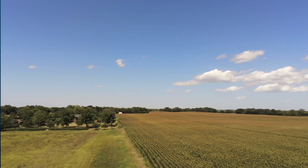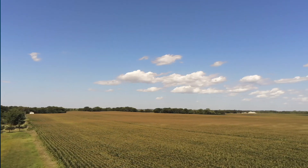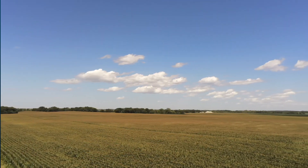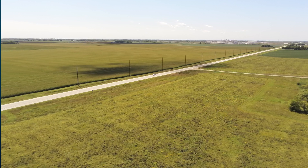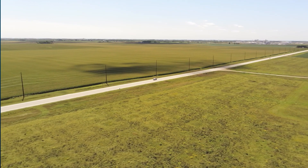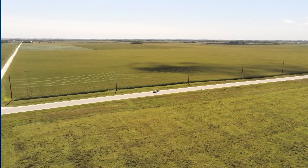If you are making some sort of index analysis and you're using a multi-spectral camera, it would be important to wait for conditions to be either fully sunny or fully cloudy. If an occasional cloud does come, you may pause your aircraft or just wait until it passes, so that you're not analyzing a cloud shadow and putting a variable rate prescription in place that would incorrectly fertilize that area.